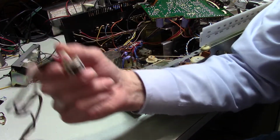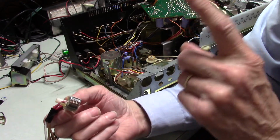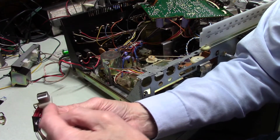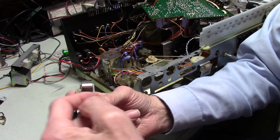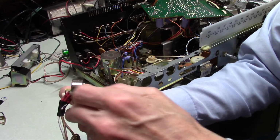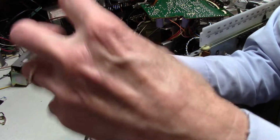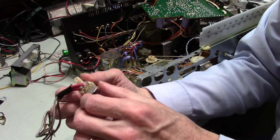So I said, well, I know I can't glue it together with epoxy with any hope of that plastic piece staying on top, but I know the epoxy will cling to the metal. So here's what I did. There's three faces that touch the tape head. And so what I did is I took my soldering iron and went inside the faces, and I cut grooves here, here, and here inside. Coated it with epoxy, put epoxy on this, put it into place, and then held it against. There's a stop here and a stop here, and another one on the bottom that align the head. Thankfully those are there, because I'd have real trouble. So I held it till it stayed tight, and then I let it sit.